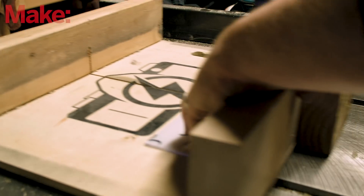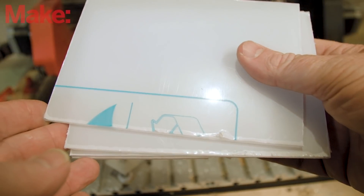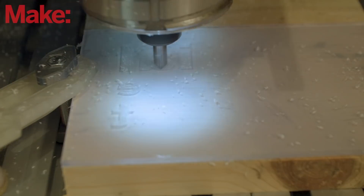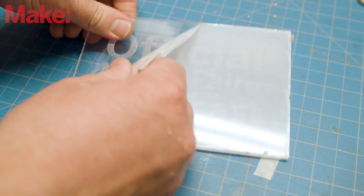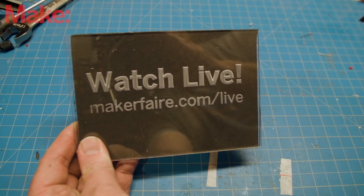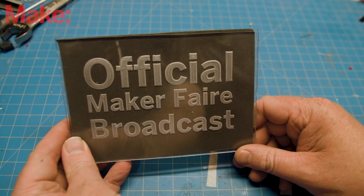After breaking down the cast acrylic on my table saw I use my X-Carve to do the sign engraving. I'm using a 90-degree v-bit and a v-carving toolpath so I don't have to worry about losing any details. I have the design reversed so I can carve it into the back of the acrylic and it will show through the smooth side. There's two sides to the sign and I'm sandwiching a piece of black craft paper in between them, so that way the two sides are clearly visible even in full daylight.